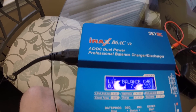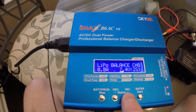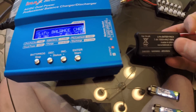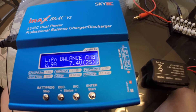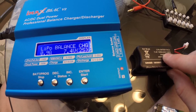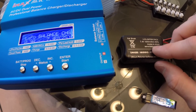There are a couple different options here. When you hit enter it'll swap down into different sections. This is how much amperage you can put in. When you look at the battery, it's 7.4 volts, which as you can see is a two-cell battery. And then it's 1000mAh, which normally, depending on the battery, you charge based on either 1C or 2C. Generally I charge this one at 1C — basically for every 1000mAh it's going to be one amp. So in this situation you would charge it at one amp.